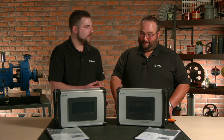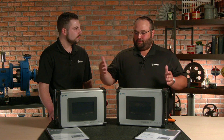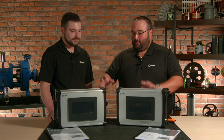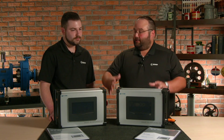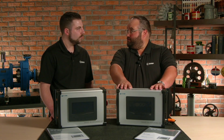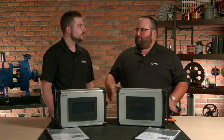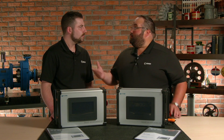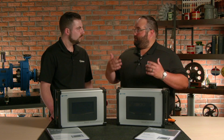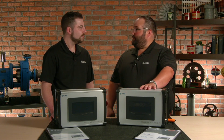I assume we have two systems here. Can you tell me a little bit about them? So when we think about this whole smart monitoring kit, they have taken that same technology in the ATTEN2 sensor and now put it in a nice little integrated package. One of these is the pump version, which is for a system that doesn't have any moving oil — maybe a large gearbox, or a drum of oil where you're just wanting to test incoming oil. The pump version draws the oil in, gives it the right flow and pressure, and then outputs the information.